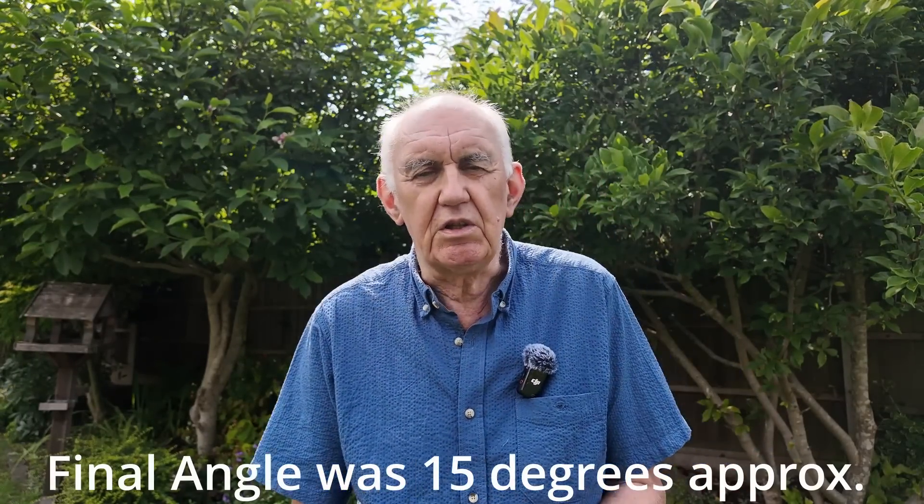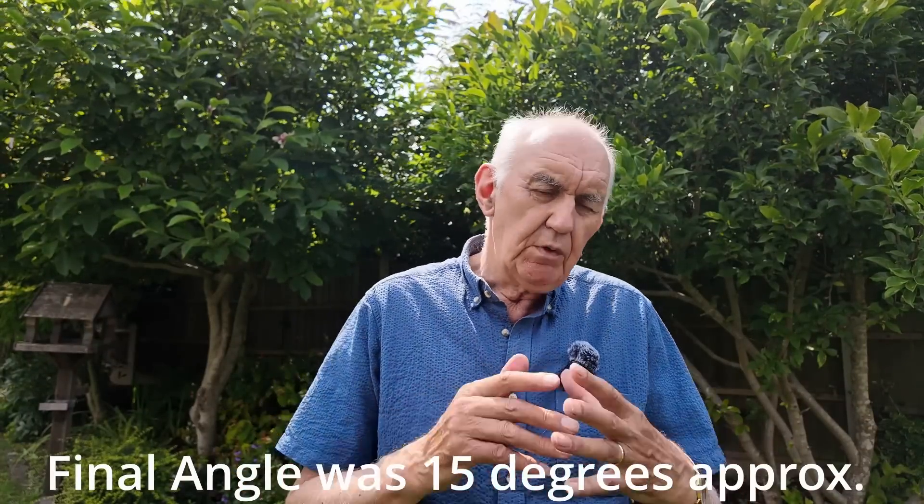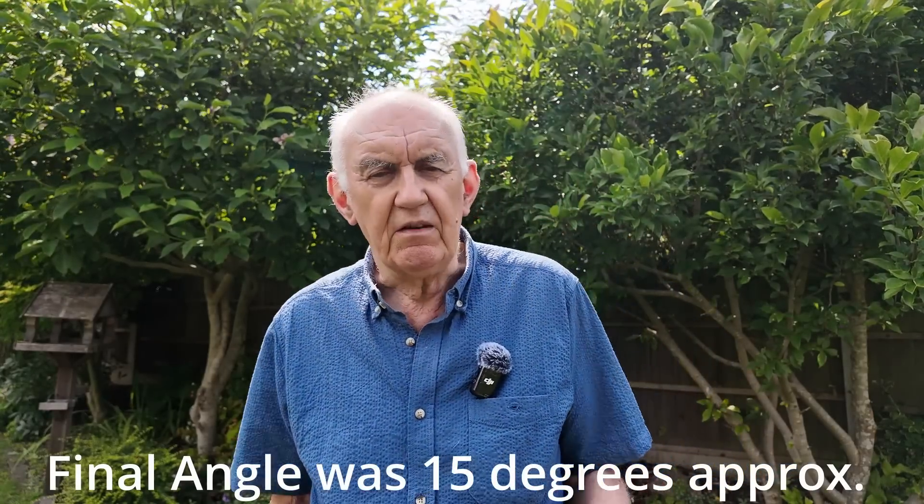We get a little bit of front-to-back ratio — not a lot, but enough to make a difference. Raising an antenna off the ground may be okay at home, but if you're out portable it's not so easy. I reasoned that you probably don't have to raise the radial off the ground at the feed point — that's a high-current point and it's not very sensitive. The part of the radial that's really sensitive to placement is the middle and the end.